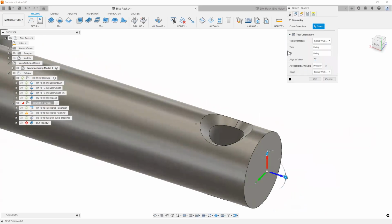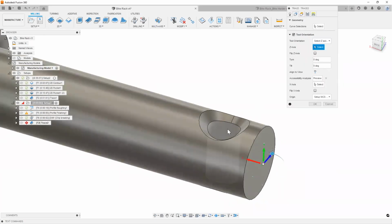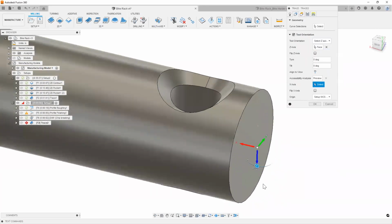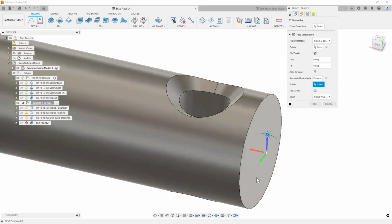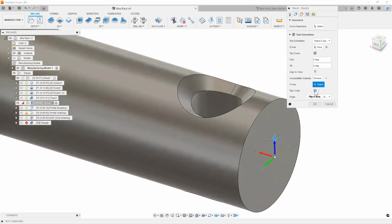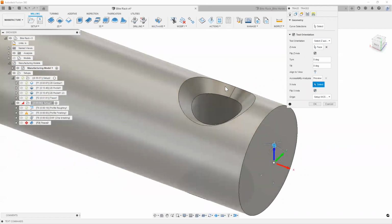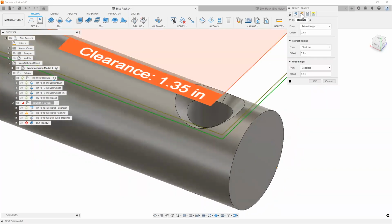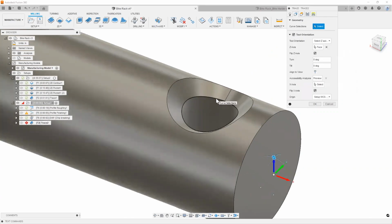Turn on auto orientation one more time. Go ahead and select the Z-axis. Go ahead and flip that Z-axis. You can also use the wheels here, in my case, to align it to a specified angle if need be. But typically just clicking a face would do the job. And then, like I said earlier, the tip that I want anyone to take out of this is make sure you turn on your tool orientation first, and then go ahead and actually select your curve.